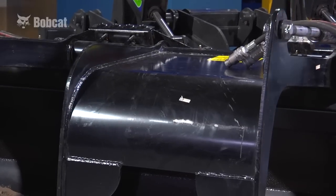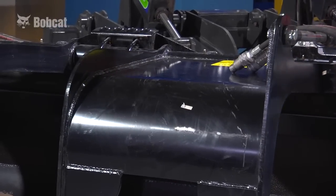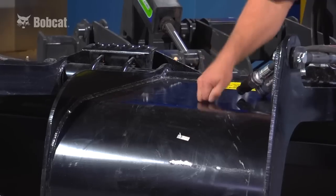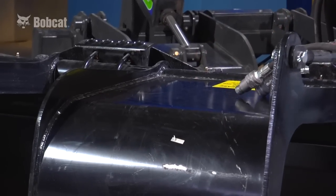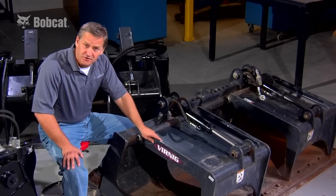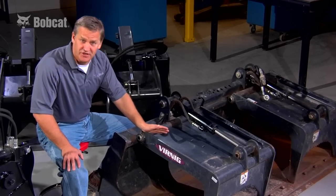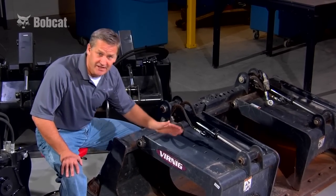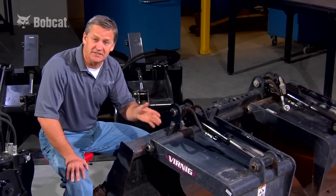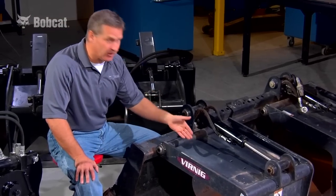The tines have much thinner steel, at only a 1/2 inch thick. And to stiffen the thinner tines, they run the sheet metal between them. That should help a little, but the steel blocks your view. This manufacturer also uses thinner 1/2 inch steel on the tines, so they need sheet metal for reinforcement. It's another grapple design that makes it difficult to see your load.